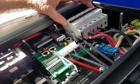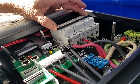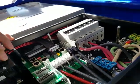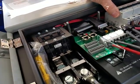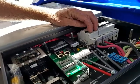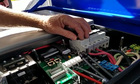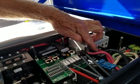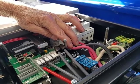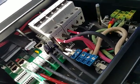So these breakers in here are for all of our AC, whether the AC is in or out. These are all AC. None of these are DC. This is DC. This is DC. This is all AC. So for those of you who don't know, alternating current: this is a 240 volt split phase system. So we're going to have two hot legs, one hot leg and another leg, each one being 120 volts, you're going to have a neutral, and you're going to have a ground. So these are all 4-wire systems.